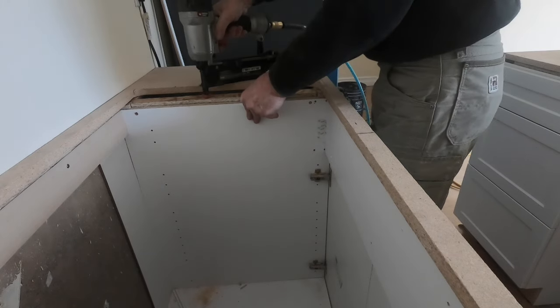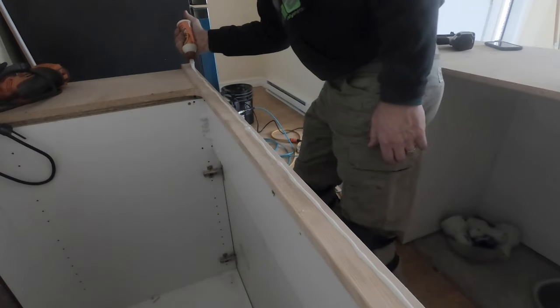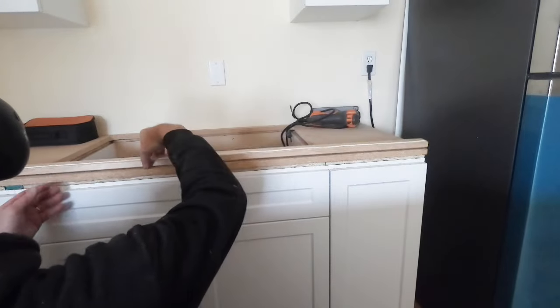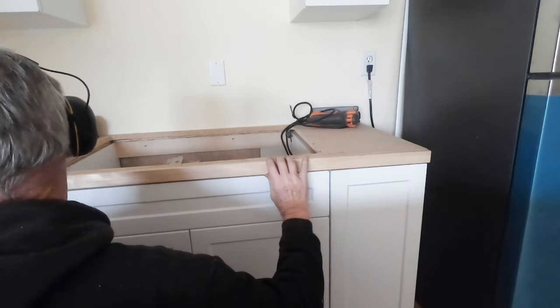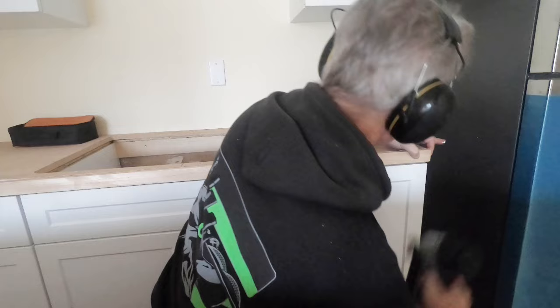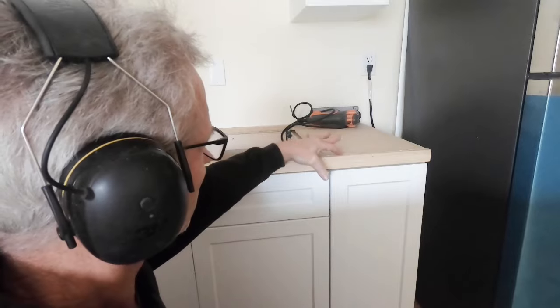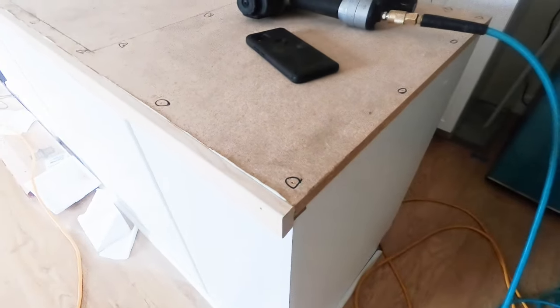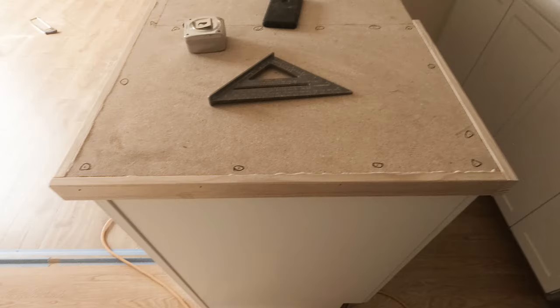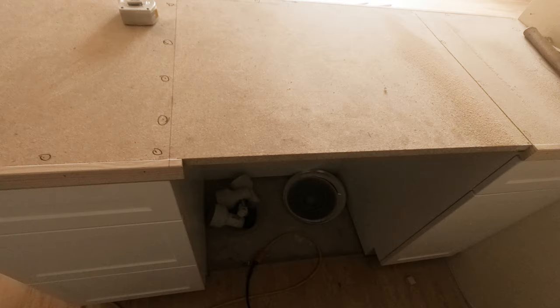After I secure this countertop, as I did the other one, I can nail on the 1x2. Apply a continuous bead of carpenter's glue where the self edge will contact the subtop. Slide it back and forth a little to spread the glue. Make sure it's flush on the end and nail it with inch and a half 16-gauge nails every six to eight inches. Make sure to aim your gun carefully. Because these 1x2s had a slight radius on the corners, I set this a little high so I could sand them down flat. Out here on this corner, I left enough room to get a piece of laminate on the end and set the other end flush and square cut. I prefer to overlap the corners — when you miter the corners, you're stacking seams, so the end joints of the laminate self edge would be right on top of the ends of the miters. I also put a little extra dot of glue on the end joint.